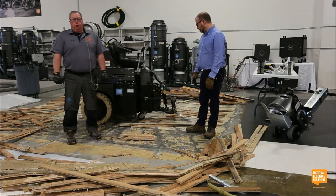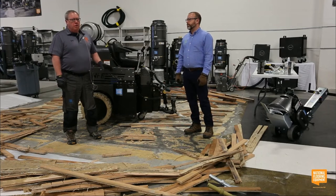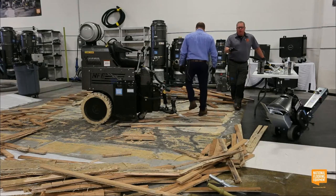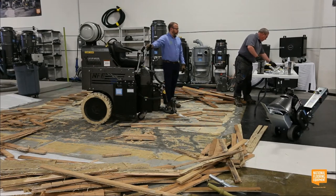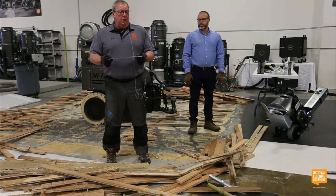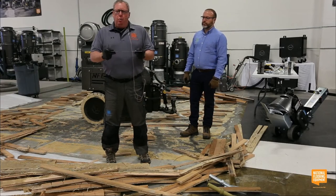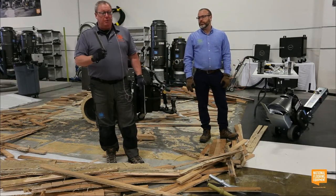And then obviously we're going to re-scrape the glue as the next step. Let's talk about cleanup of some of your tooling. The next step in how do you remove wood flooring is re-scraping the glue — how do I take the glue up? Super popular question. There's a couple of different ways. We're going to put a holder on once the wood floor is out of the way, put on a .094 spring steel blade at a pretty big angle so we can re-scrape the glue. You can use a .188 too — if there are little pieces of wood floor still stuck, that's a much thicker blade. Also, one of my favorites is a one-inch blade.